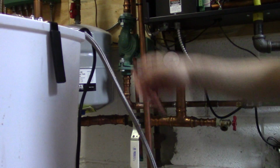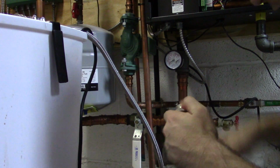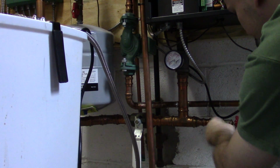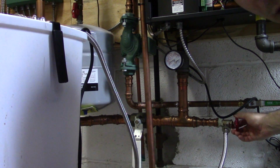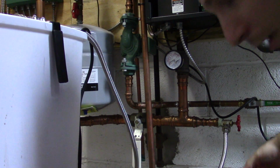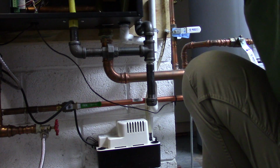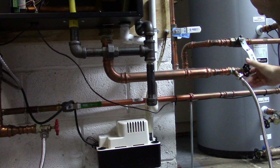And we're going to go back, valve this off, remove this, and put it back on our inlet or supply side. We're going to open up the valves to these guys. So right here, that's one. And you want to open up all the way. If you crack them, sometimes they'll leak a little bit. So one here, and one here. Remember, one of these guys leaking.